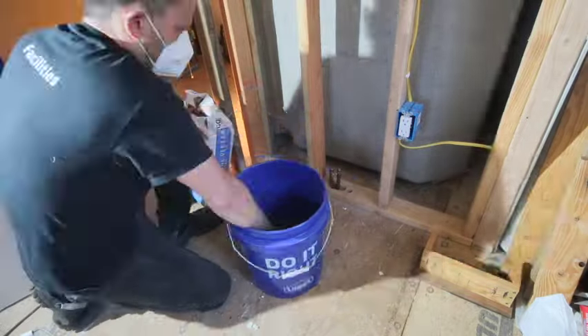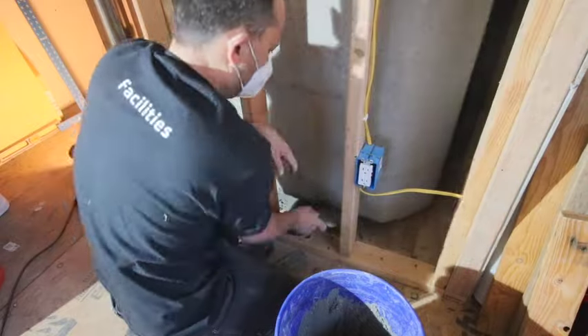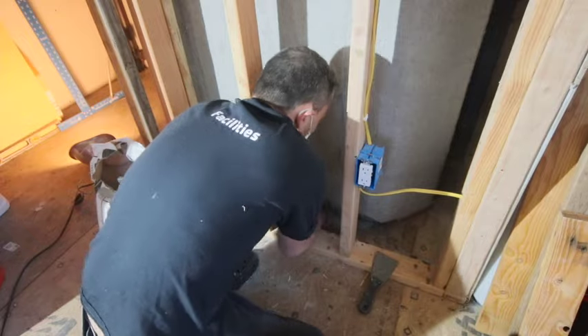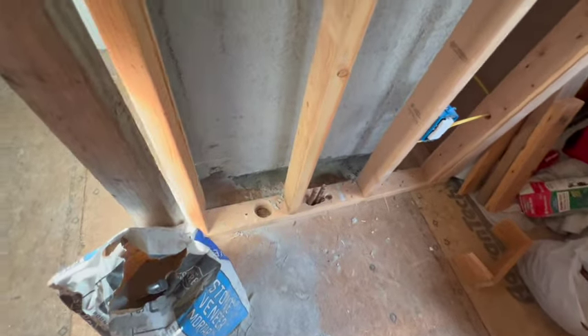Now I'm just going to get some mortar in there as a little base to tighten it up on the bottom. Mixing up some mortar — put some mortar in there, add water. I used stone veneer mortar only because it was the cheapest I could find. It just needs to be sand that sticks together and I think it'll work well. The next day it's almost dry. When I put my hand down I can feel the mortar made it out about halfway. When I step on the mortared side it's so tight, and on the other side I can feel it flex a little. That makes a big difference — I'll go underneath and throw some more up from underneath in the gap.